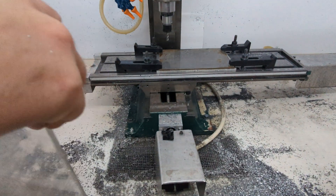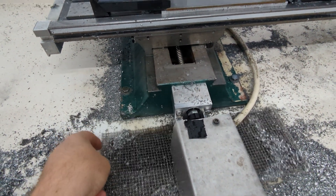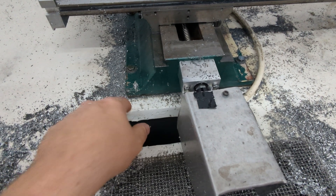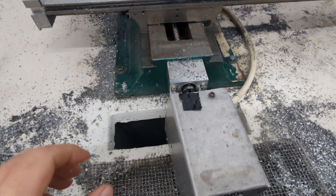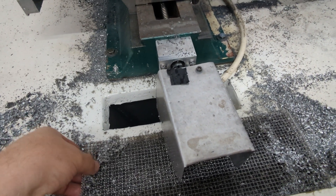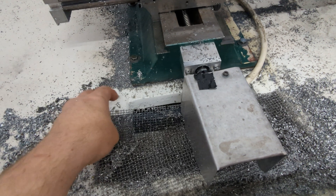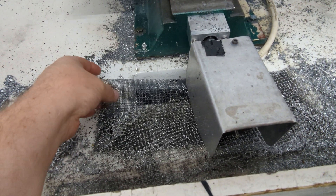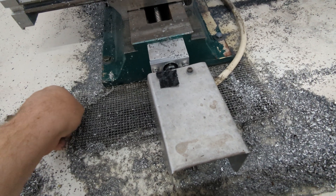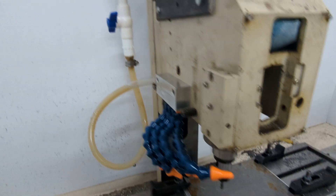Inside the pan, I changed the drain — there used to be a sink drain right here but I hated how quickly it would pack full of chips. So I cut a 4x11 rectangular slot and then 3D printed a flange in two pieces, then fiberglassed and epoxied them together flush into the bottom of the pan. For the pre-filter I'm using hardware cloth at about quarter-inch spacing, two sheets of that, and in between is nylon window screen material. It seems to be working pretty good, though it's still a little restrictive.